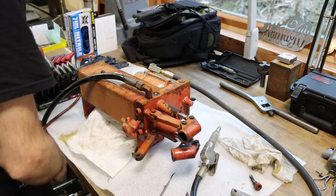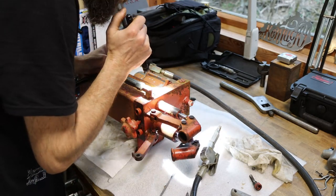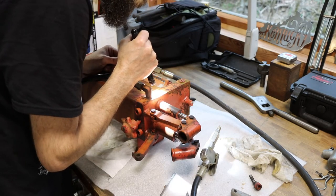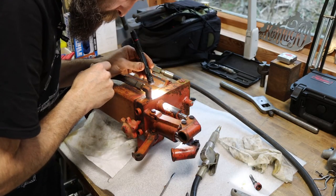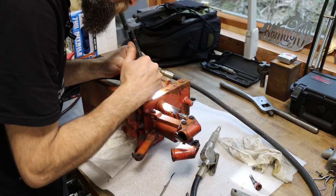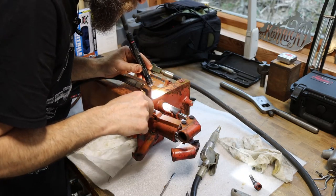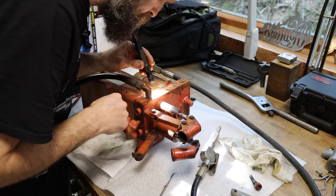And just from looking down in this cheap pump, I can tell you it's probably because of a burr from the machining process. Could be just dirt, right? But I'm seeing some burrs where they machined the small holes. I've already cleaned off a few. So small I can't show it on camera, but you get the idea.